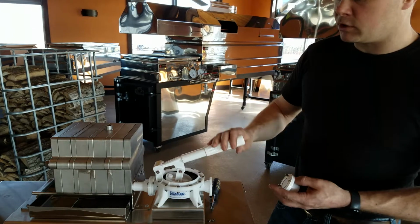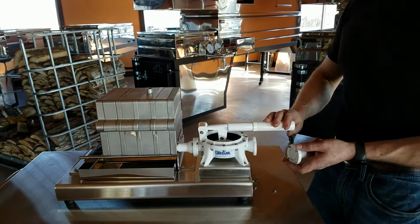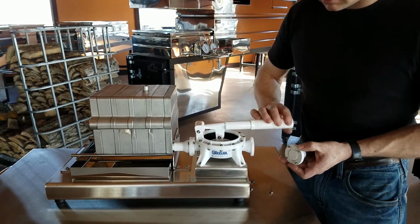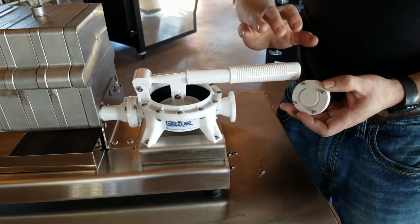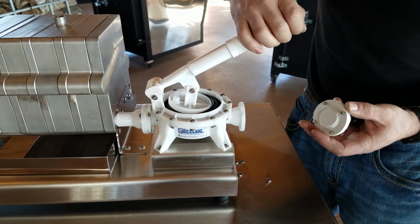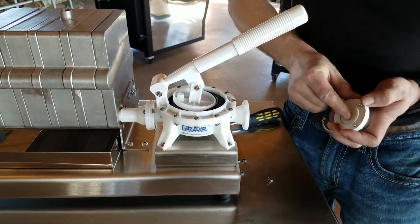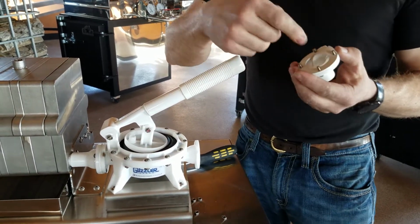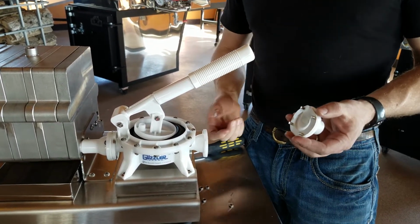So you see what happens when you are pushing down on this handle very, very hard. First of all, when you're pumping this pump and everything is working well, when you pick up the handle, you'll see this valve will open, like so. Now, let's just say you pick up the handle and you push really, really hard, and you're exceeding the limits of the pump, and when you push the handle down, this valve will actually get inverted into that inlet pipe. That's the problem. That's why syrup can now backflow back into your container that you're trying to feed out of.